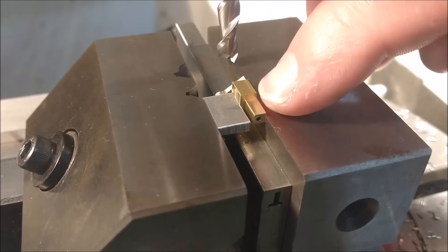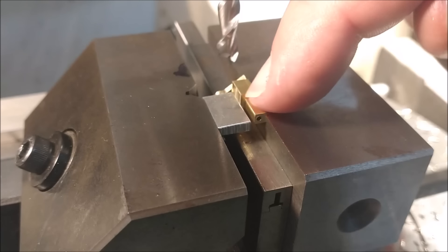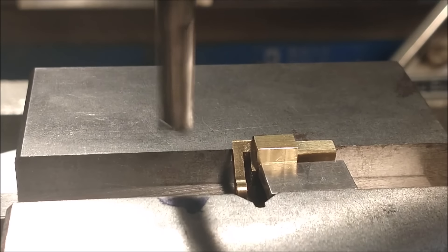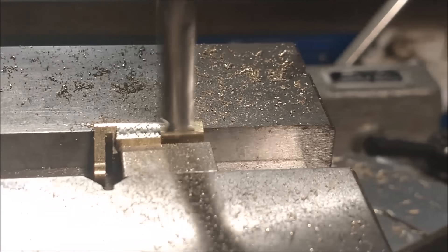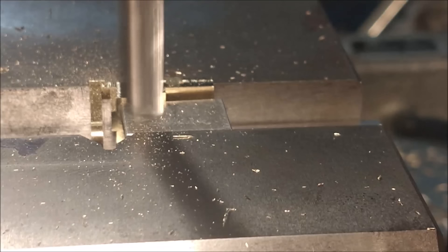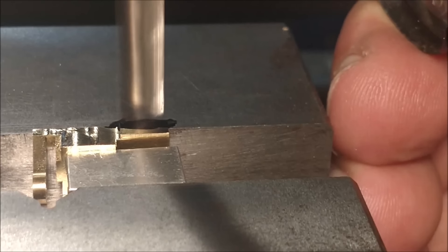The center boss needs to be knocked down to form an undercut between the T-nut body and the tapered part I did initially. I have an aluminum block in there pressing the part against the stationary jaw. You need to establish a 0.250 front with a step down of about three-quarters of a millimeter. This operation will create the undercut between the T-nut feature and the little lollipop on the end, and one side of the thinner T-nut profile cut. Some of these cuts are very small even under magnification.